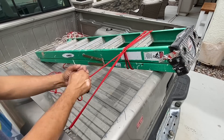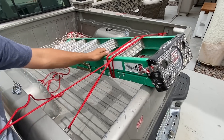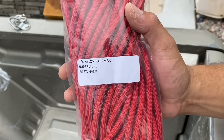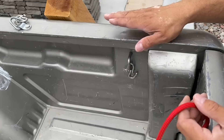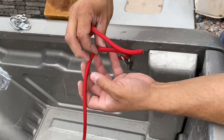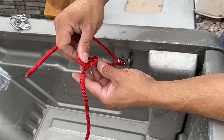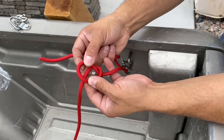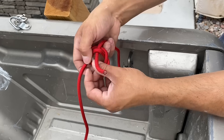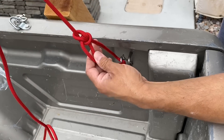This allows me to pull tension in the rope without it slipping. I'm using quarter-inch nylon paramax. On this side I'm going to tie in with a simple bowline knot — hook into my shackle, twist an overhand loop, twist that overhand loop again, and push that working end through that window I just made. Pass my free hand through, and when I let it spill it will turn into a bowline.